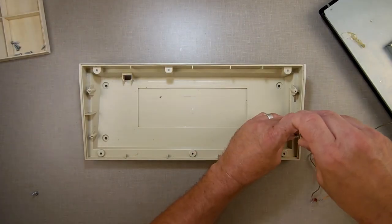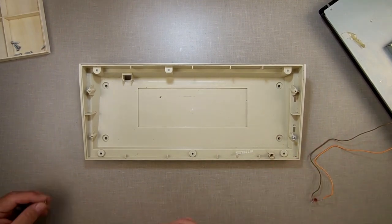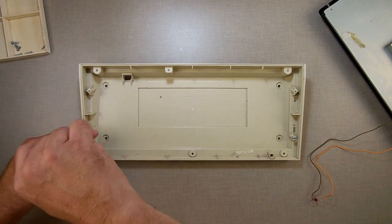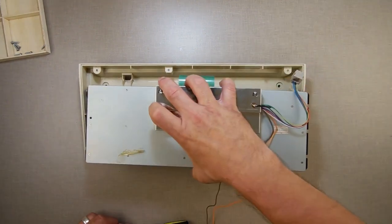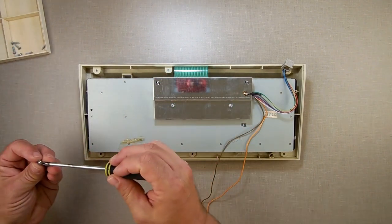All right, so I just recalled that instead of spacers, what I did the last time is I took two of the screws that mounted the keyboard and just slightly put them in the hole so that they don't come out, so like maybe two or three turns. And then what I do is you take this and set that on here and take the other two screws